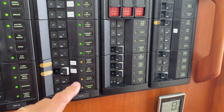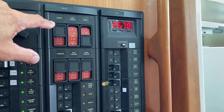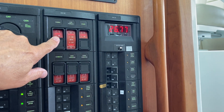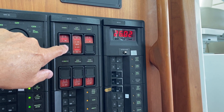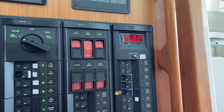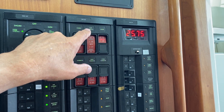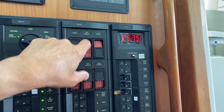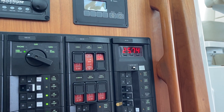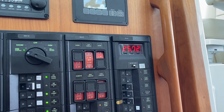Then this section — here we are with the orange lights — these are DC loads, and at the bottom of that panel it says 12-volt DC. These switches control the different batteries in the back lazarette of the boat. The engine switch you simply turn on, which energizes the engine battery. These switches trigger toggle switches in the back lazarette, not dissimilar to the old red rotary switches. This is the AC parallel — I've been told you should always leave that in the auto position, which allows charging to go both to the engine bank and the house bank. And then these are for the generator battery, the bow thrusters and stern thrusters, which do share some of the batteries.